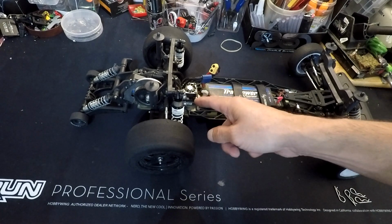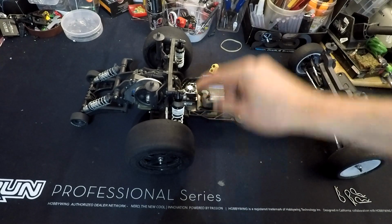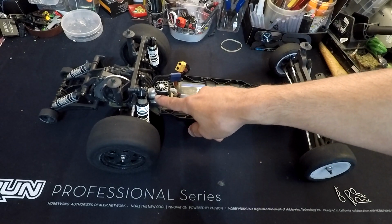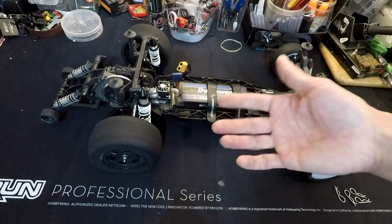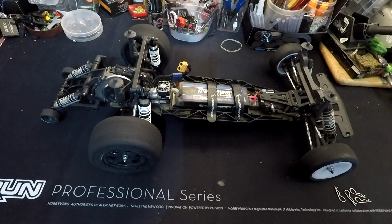The power plant in it is actually a 5-turn. This is the same motor that I ran at the rear race. Same speed control too, an XR10 Pro 160. I just had to make the wires longer. And I did replace the power caps with the quad cap bank. Anytime you're doing a lot of high current stuff or repeated full throttle or lots of launches, the caps always help. Basically, capacitors always help. So I always try to put the bigger caps on all my builds.